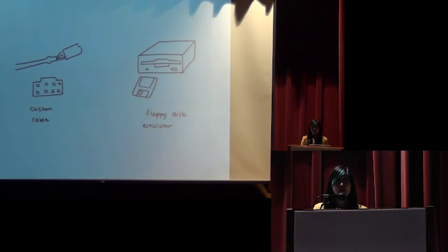So because the knitting machine was from the 80s, it used to take additional patterns via a floppy drive. And so we had the idea of emulating a floppy drive and putting our own images on this fake floppy drive and sending them to the machine that way. So we found a script that emulated a floppy drive, and we found some documentation that showed the custom pinout for the serial port of the knitting machine, because it was a strange pinout, so we had to make this cable ourselves.